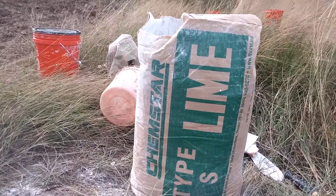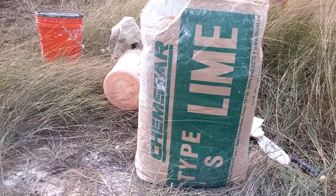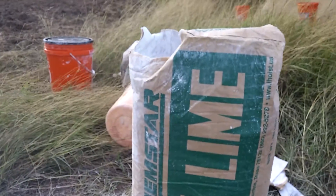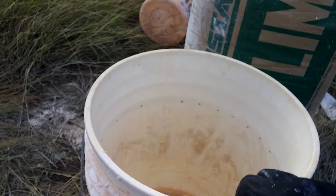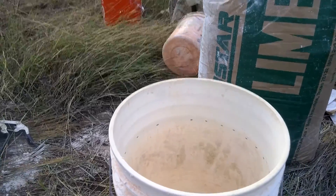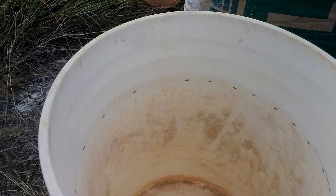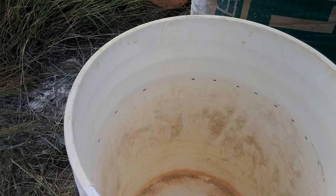Our ratio is one gallon of Type S Lime. Whenever we measure a gallon, it's really powdery stuff and you just kind of shake the bucket. You put it in there and beat it down and it's going to slowly just drop. We are using these buckets for measuring — you can see on the inside there are little black dots with permanent marker. That measures four gallons for one of these buckets so that we can get pretty precise in our measurement.